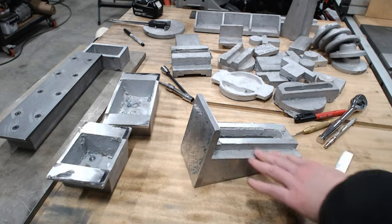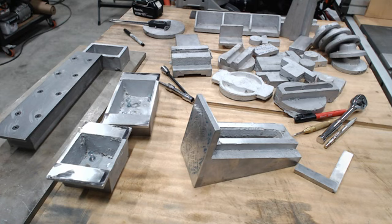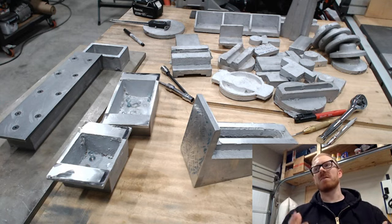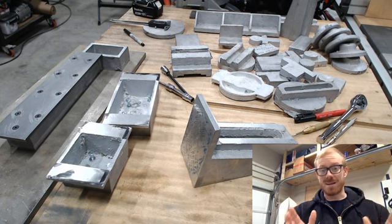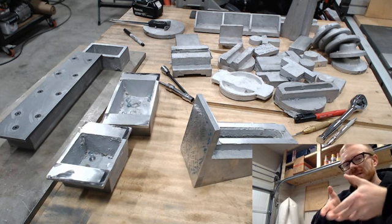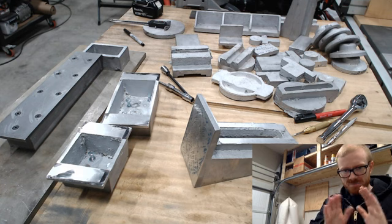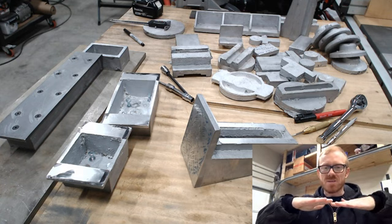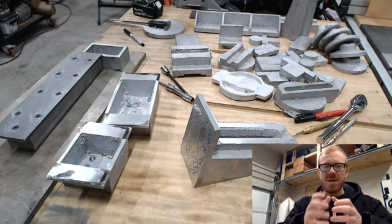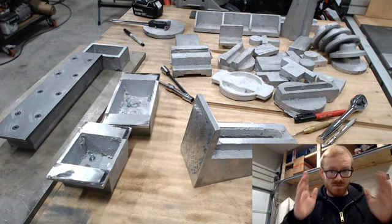The top surface here was not too terrible, but it also took a while to sand. Furthermore, I used the 12-inch disc sander that I have to sand that down. And one of the things that I learned, I feel like it's an important lesson, is that disc sander really tends to make a round surface, because you can imagine what's happening is as you're holding a part up against that rotating face, it tends to kind of bump around. It's not like when you're on the surface plate, sanding against a flat surface, where you have much better control of the part. It's less likely to tip or get caught from the power tool, from the sander. So that was a big thing to learn.